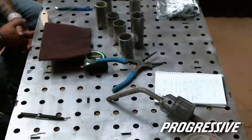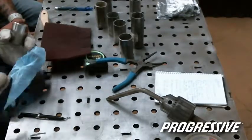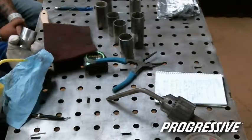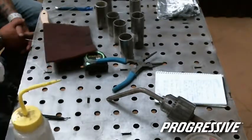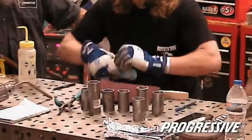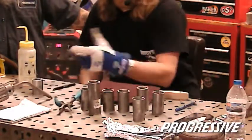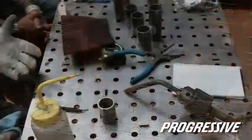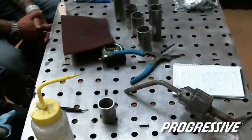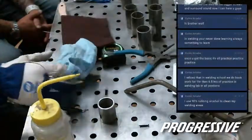We do it all the time, and it still makes me laugh how you're doing something in such a dirty environment. So we'll take the acetone and also take off the Sharpie marks. But just simple prep inside, outside. Aluminum is bad. If you're welding flat plate, you want to prep the backside of your weld because it'll draw it from the backside through. And that sucks.